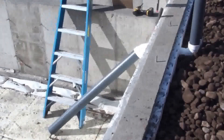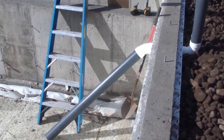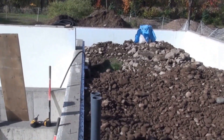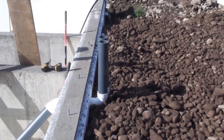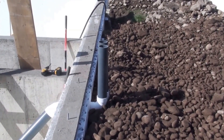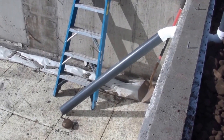I wanted to show you over here, going between this side of the chicken coop and this side of the greenhouse — this is one of the large thermal mass stone areas. Down here I've got it plumbed to ultimately take heat from the greenhouse roof, come down through a dehydration unit built within the storage unit of the chicken coop. It'll be a top-down system: heat off the roof goes into the top of the solar dehydrator, down through the floor, and gets redistributed during the winter months into the thermal mass unit of the greenhouse.